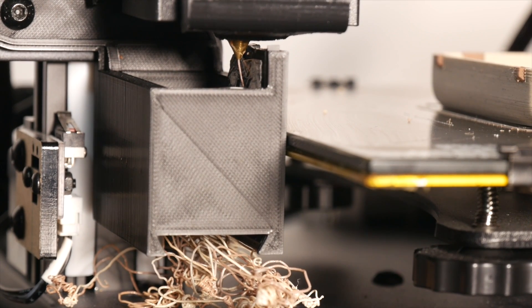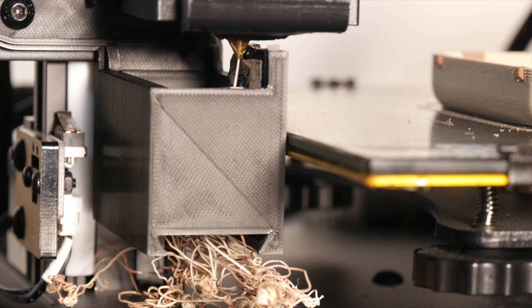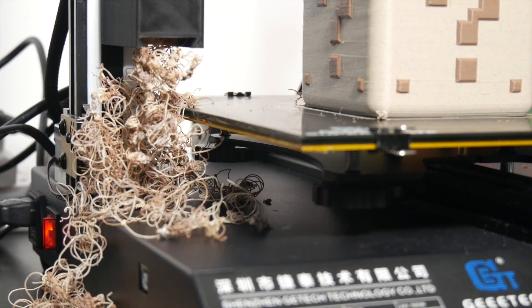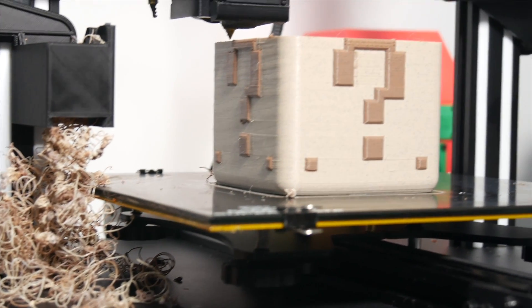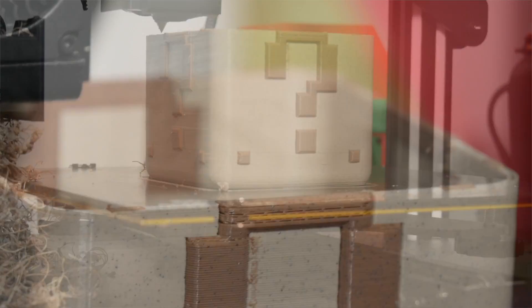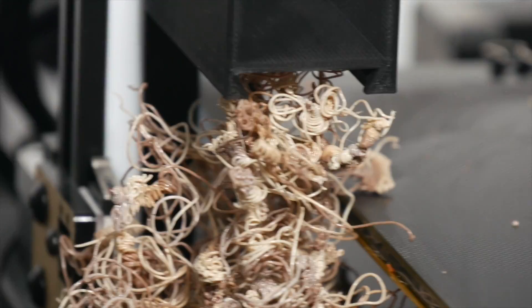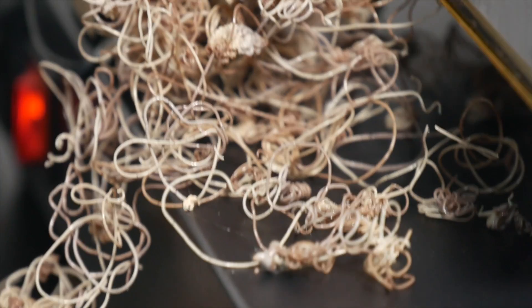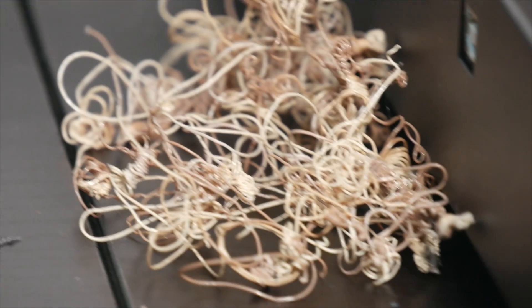To install this, I used the same two screws that are on the X gantry. Since there are lock nuts and not enough length in the screw, rather than changing the screw I simply tightened the lock nuts inverted — lock part first — and that worked beautifully. The good thing is that it moves upward constantly with the Z-axis, so the nozzle is always at the same height relative to the purge bucket. It has a drawer at the bottom you can remove. The higher it goes the more room you have for the purge to come out. Purge buckets are definitely a better way than purge blocks.